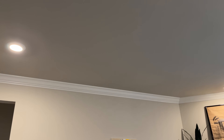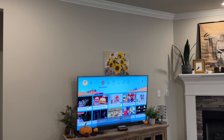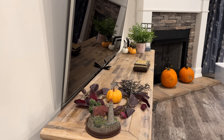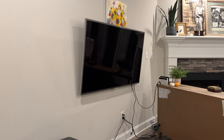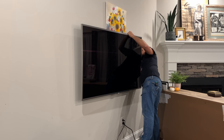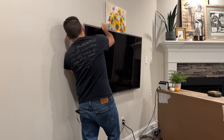I think the aesthetic looks good overall. I'll be using this light in the living room as a reference point — staying to the left of the light will allow me to drill a hole more accurately through the 2x4 so that when I pass the cables through from the attic they'll be in about the right place. Despite the sound bar blocking a portion of the TV it hasn't been an issue since most content we watch is widescreen. However I want to remount the TV higher because I plan to purchase a center channel speaker that will be mounted underneath, so we need to raise it at least 10 inches to accommodate in-wall speakers.